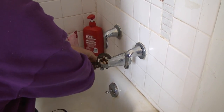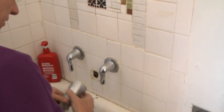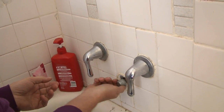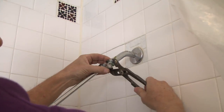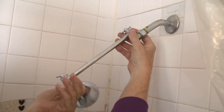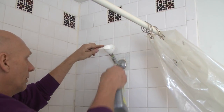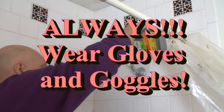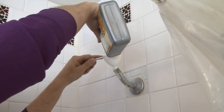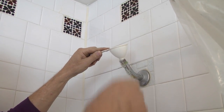First thing is take off the bathtub fill spout. So we're going to cap it with just a regular fitting. At the top, we're going to unscrew this fitting right here, and we're going to pour our CLR in here and fill up this whole line. Our little pump didn't impress me that much, so I decided to just pour the CLR in until we get enough in there. I think we may have gotten enough in there now.